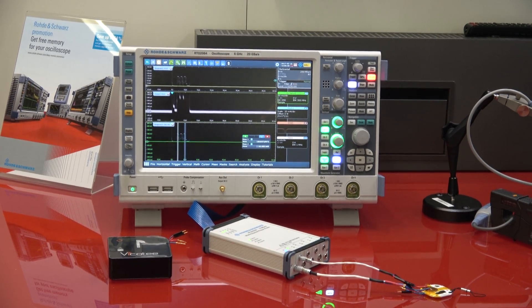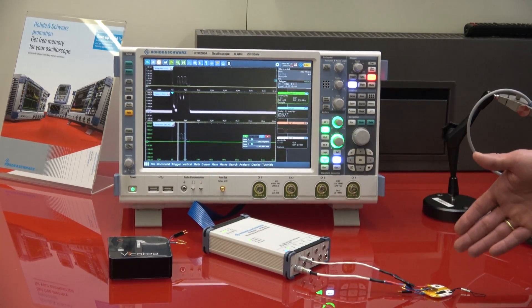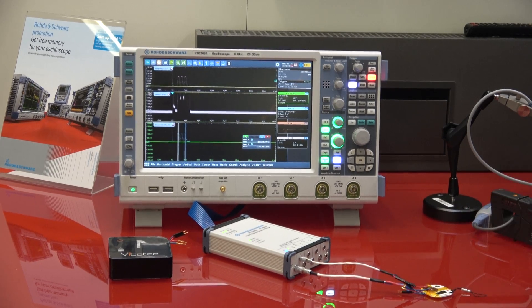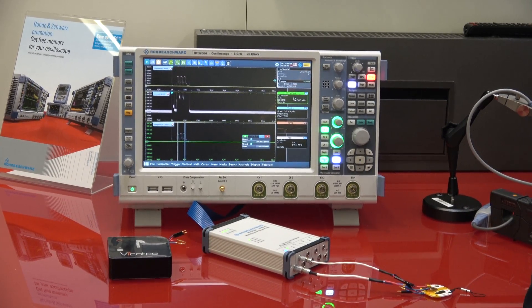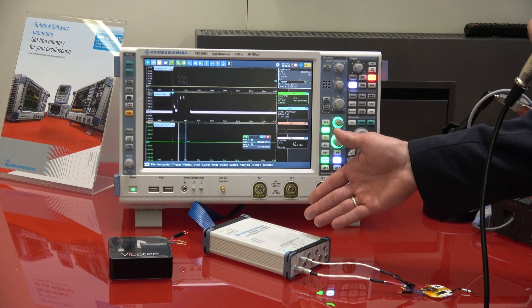What you can see here are typically IoT devices. The latter one is a Bluetooth key finder working with the Bluetooth Low Energy protocol, saving power by operating only for a very short time and then having a long period of very low current. This is the main measurement challenge that we can solve with the probe we launched recently.